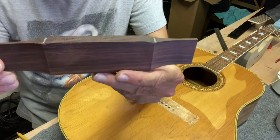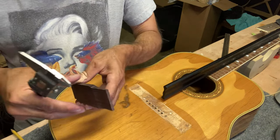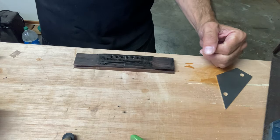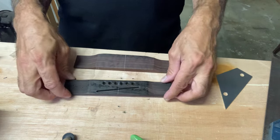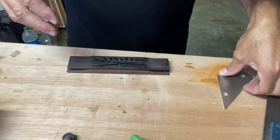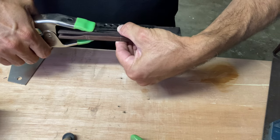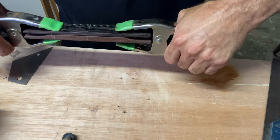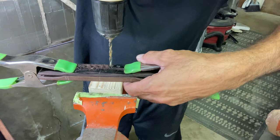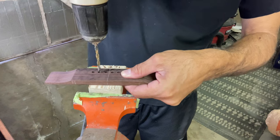It's still quite a bit thick, so I'll take this back to the spindle sander to get it to the proper thickness. Here's the original one I built for that guitar — it's super thin and just a rectangle. This is the new one, and I want to transfer the holes into this bridge. Before I contour the top while it's still flat, I'll clamp the old bridge to the top, take it over to my homemade drill press, and transfer the holes — using the old bridge as a guide, then drill the rest of the way through in a scrap piece of pine.